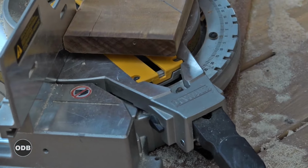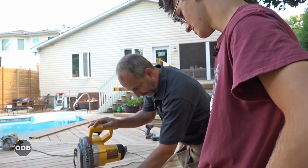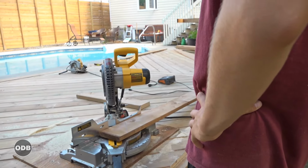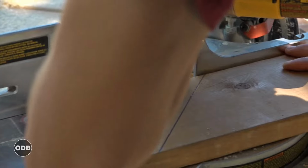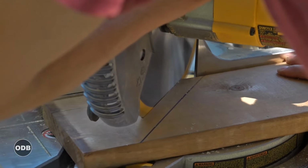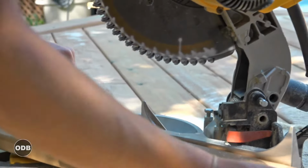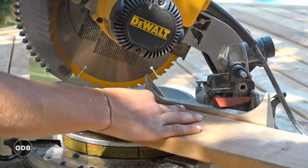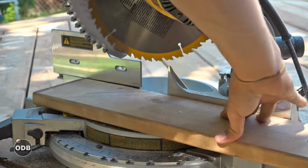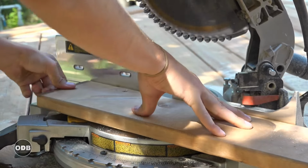Now, we want to cut this so that the pencil is left showing. Yeah. So you want to cut so you can see the blade on the other side. First, cut about a half inch away so you can confirm that the angle's right. All right? Okay. We'll hold it flat on the guard on the back of the saw. Now cut that bad boy and let's confirm the angle. How's that look to you? I'd say 45. Now cut just a hair to the right of that first cut line, okay? Okay, sensei. Go. How's that one look? That looks a lot better.